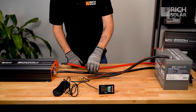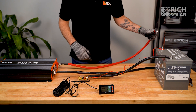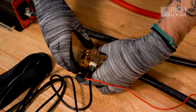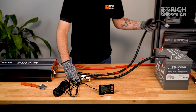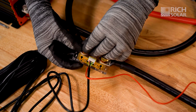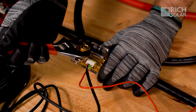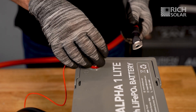To connect the rest of your devices, the shunt now acts as your negative, and the positive you connect normally to the battery. So now we're going to hook up the negative of our inverter to the shunt on the P-minus terminal. And then we're going to connect the positive side of our inverter directly to the battery.